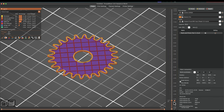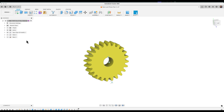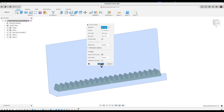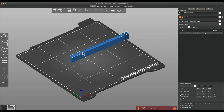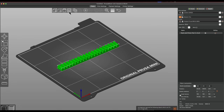The simulation looks good — 28 minutes — and I'll export the G-code. Back in Fusion I'll untoggle the spur gear, toggle the rack, right-click, Save As Mesh, and send it to Prusa Slicer. This one goes to the Mini, so I'll change the printer from the MK4 to the Mini. I'll click Place on Face, select the bottom surface to reorient it, then center and arrange the object.